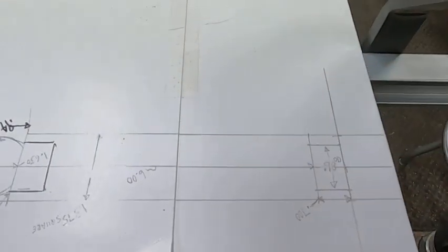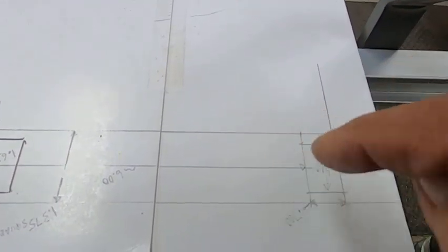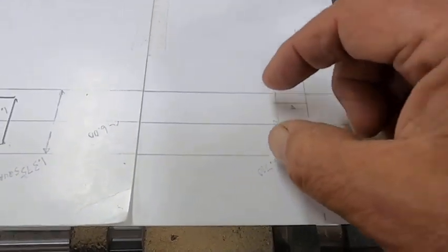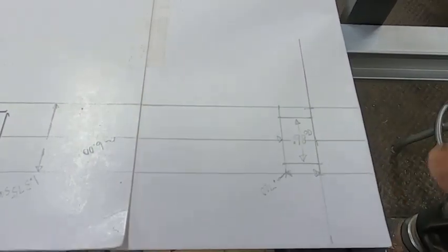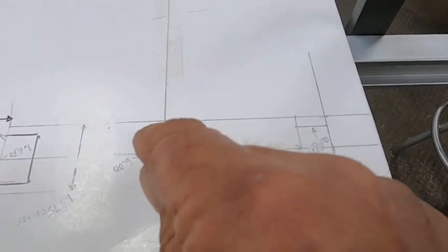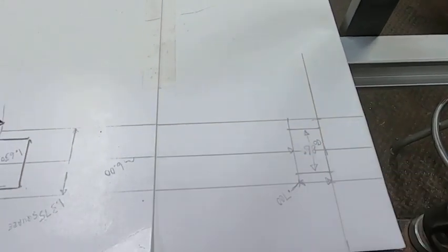The top has to set up into the socket, and the bottom has to slide into the stairway, and then the tenon has to fall down into the hole. So what I'll do is I'll make this tenon basically a dowel, and it will have a spring up in here in this area that'll push it back down in once I get it.